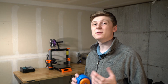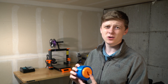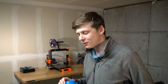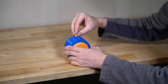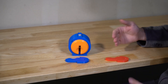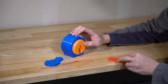For the first prototype I decided to go with a scale model — scale models are great for bringing things to human sizes. This is a four-times scale model, so four times larger than the actual lock. Since the pieces are so small, this is a two-pin lock, and you can see the three main parts: the core, the mid core, and the shell. The pins are also 3D printed. With the lock assembled — one key that will work and one that won't — the correct key inserts and rotates as much as I like; the wrong key barely rotates at all.